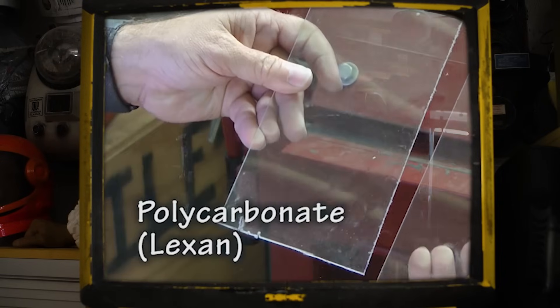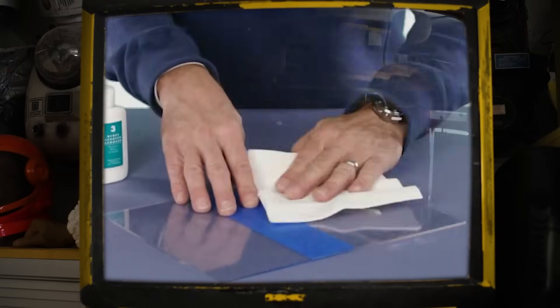Lucky for us, I've got a dome guy. His name's Rod. Nice guy. Loves domes. The only problem was I couldn't decide between acrylic or polycarbonate. Acrylic is fairly scratch resistant, and if it does get scratched you can buff it out, but it's not the strongest. Polycarbonate, on the other hand, is virtually indestructible but scratches much more easily, and once it's scratched, it's scratched. So acrylic is optically ideal and polycarbonate is structurally ideal. Solution? Panic, buy both, just in case. Either way, it was going to take three weeks to have my custom domes made. Also worth noting, a real bowling ball is eight and a half inches in diameter, but the closest dome size I could get made was eight inches. Will that half inch make a big difference down the road? Yes. Yes, it will.